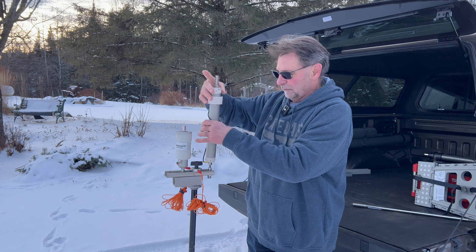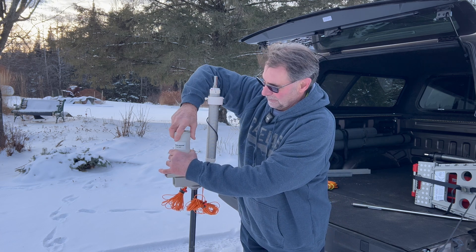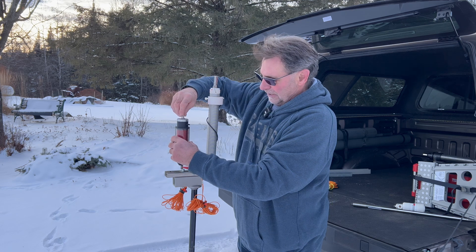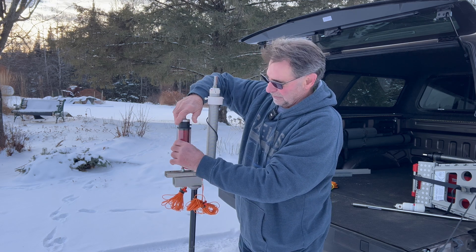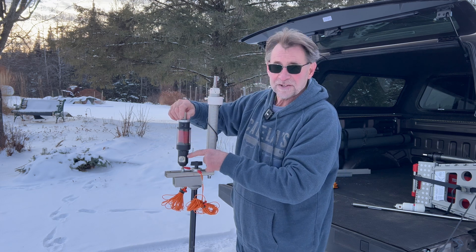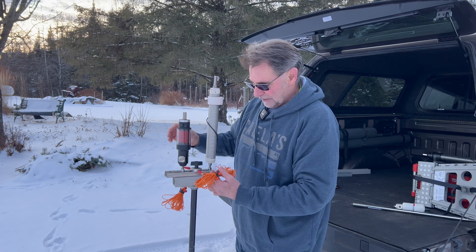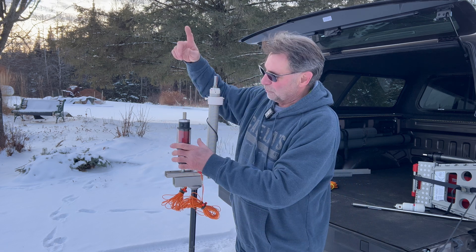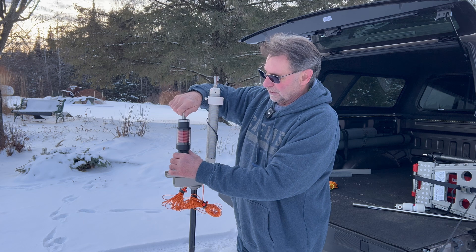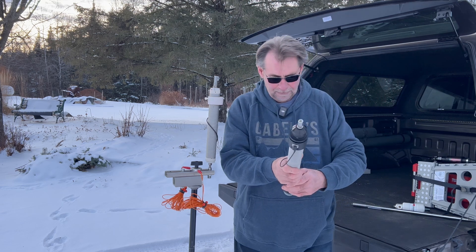You can put on your Wolf River Coil with your top antenna on top and go, if you don't want the Chameleon transformer — it's a 5-to-1. Or go over to a Recon 40 from RES Antenna System — a beautiful, fast system. Put a 17-foot whip on it; there's a switch to completely bypass the coil for just the 17-foot whip. Hook your coax into the SO-239, and you can switch between 20 meters and 40 meters automatically with the coil.